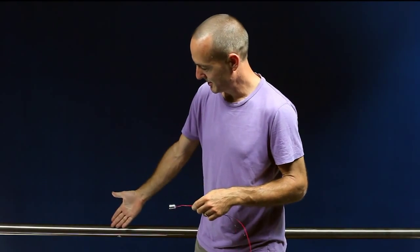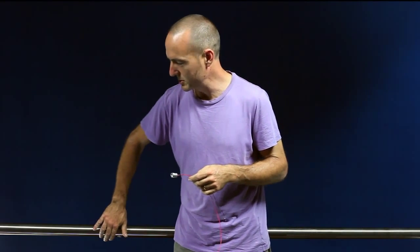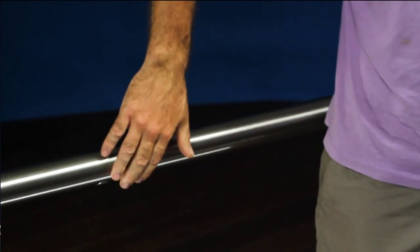The HLS uses any metallic handrail — we drill and tap holes into the handrail and the Mini Puck is inserted in, with power reticulated through the rail. The whole idea of this system is that it provides an invisible light source to any path or stair that you might need to illuminate. Its big advantage over pole top lights is that it's a very efficient light source with no wastage, no light spill, and more importantly, no glare.